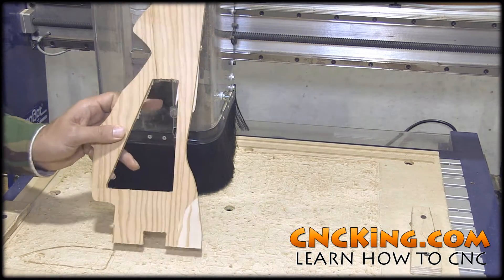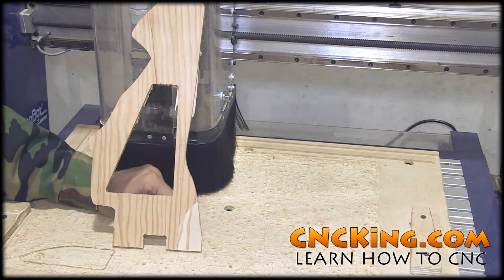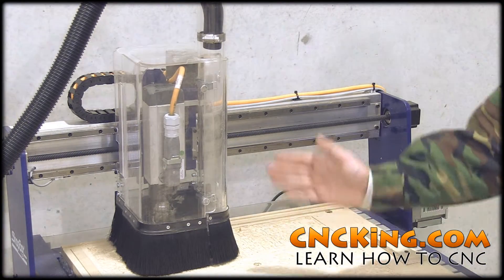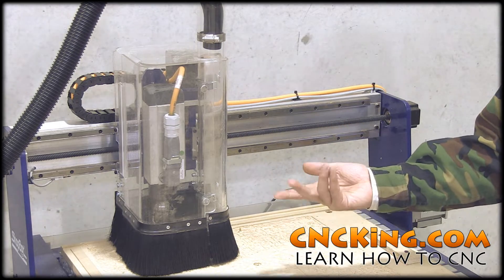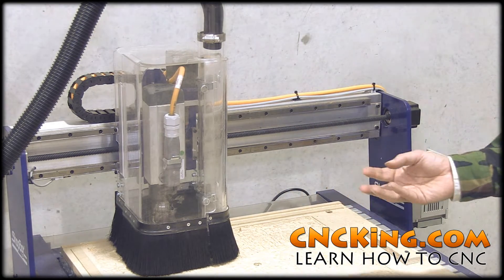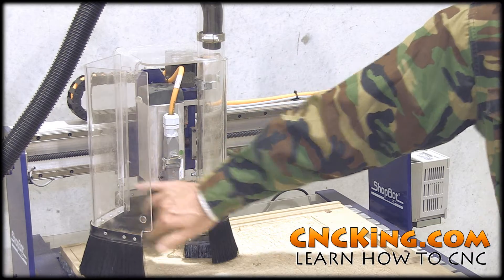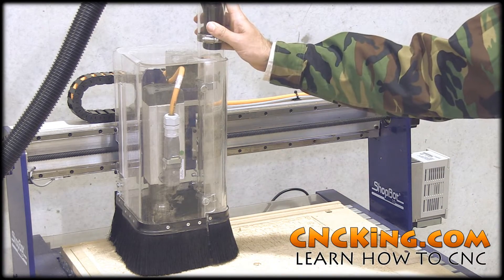Let's take a look at this model here. You'll notice that the inside edges are round. I could have put dog bones and have a sharp inner edge, but I'll never have a true 90 degree straight edge like I will with the laser. Another major difference is that for a laser, after the material has been cut and engraved, it's vaporized as fumes and easily extracted. With the router, you end up with wood chips and a lot of dust and debris on the board itself. If the bit goes over again and again, you end up introducing extra wear and tear on your machine, so it's very important to have a good extraction system — in this case a vacuum cleaner.